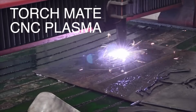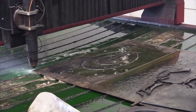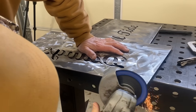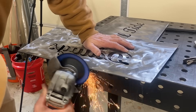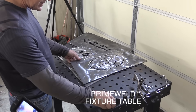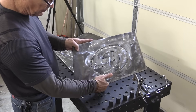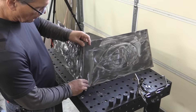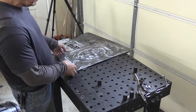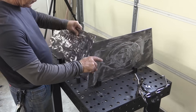Let's get into the video. We're going to put together a fire pit kit today that was cut out for me by my friend Matt Hayden using a CNC plasma table. This is part one. I'm going to do some TIG tacking and TIG welding on this one, then finish it up with MIG welding in part two. It's not much fun TIG welding plasma cut surfaces, so the first thing is to hit that with a flap disc and get it nice and clean on all these edges. It's 11 gauge steel. Because it's CNC cut, I know all the edges are straight and accurate, and if I just line them up on a flat surface they'll fit themselves together. I'm going to use lineup pins because I got this fixture table from PrimeWeld - it's got all the holes indexed, and this thing should just fall together. All I've got to do is take a couple of pins each way to get a 90 degree angle, slam them up against that, and make sure that joint meets with no gap.